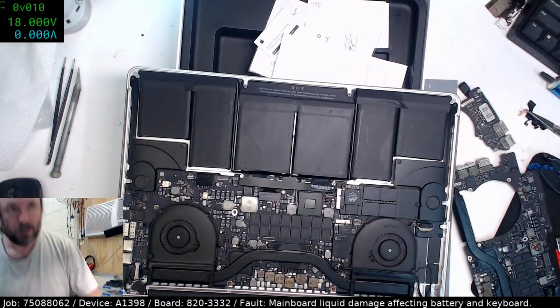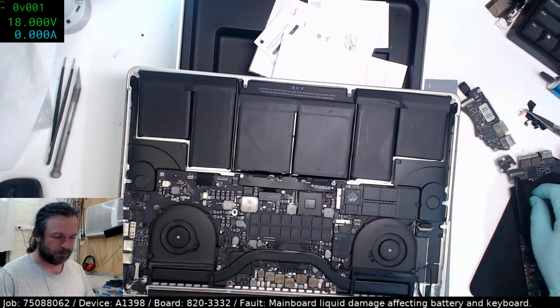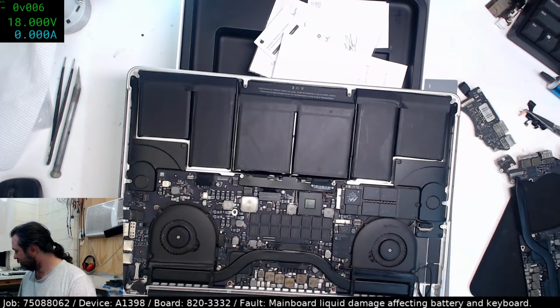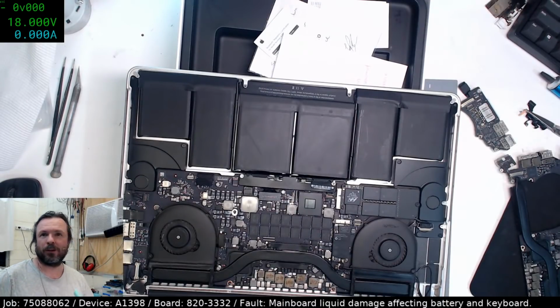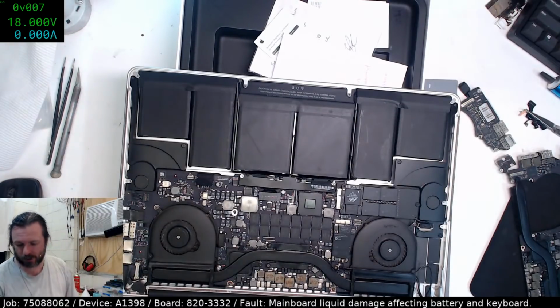Get some extra light in here. Can't believe this little thingamajig made my life difficult with that motherboard. I think I'm going to have to at some point drop the money and buy an 85 watt Apple brick, MagSafe 2, just to get a cable for the power supply. Given that it's only 2 core though, you could always just put a 2 core DC-DC plug like a JST or XT60 or something, or even just a DC jack for that matter. Mind you, you'd want one that can handle the 4 or so amps, because they usually draw around 4.5 amp when they're charging.